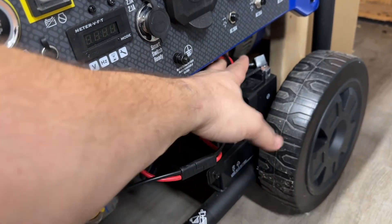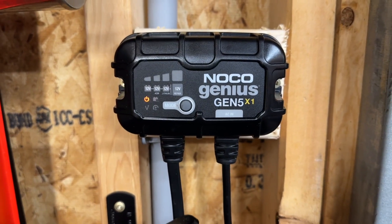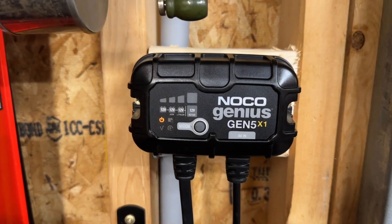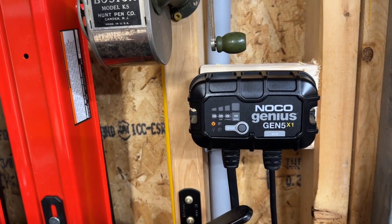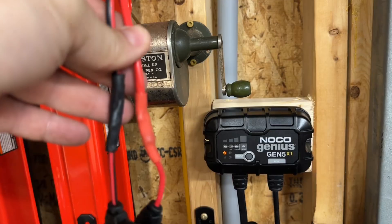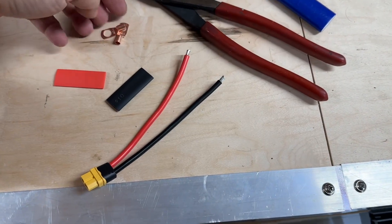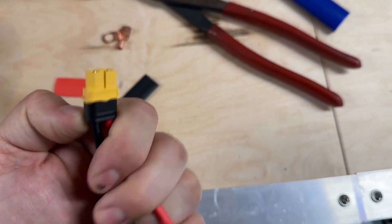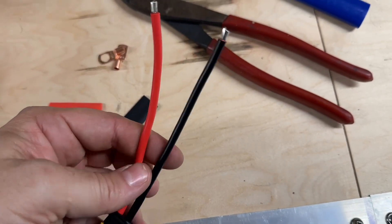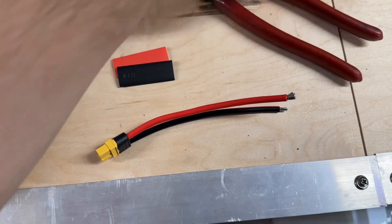I built an XT60 connector, put it on there, hide it away, and make it compatible with my NOCO charger. This is the little charger I've been using to top all my batteries up — this is not a sponsored video, I just really like it because it's wall mount and a nice design. It's the NOCO Genius. I took the factory lugs that came on it, cut them off, and mounted an XT60 on here. It's fused on both sides. Simple tools: a crimper, a couple of lugs, and the XT60 connectors — I'll link below. They come pre-wired. If you don't have fuses on your charger, make sure you fuse this side of the connector — you need a fuse in-line. Got some shrink wrap and a lighter.